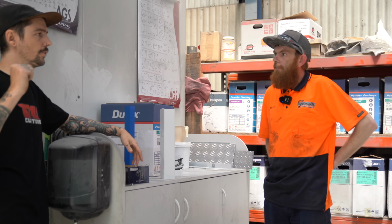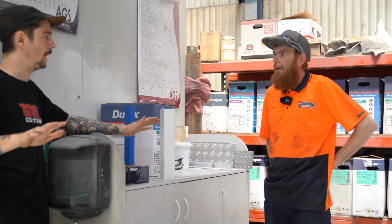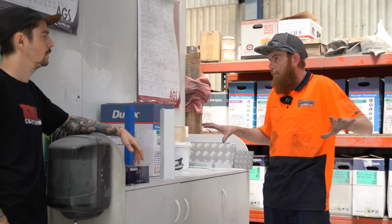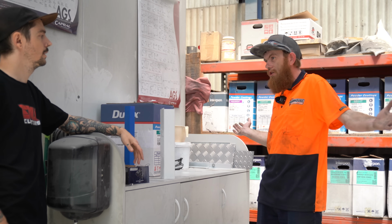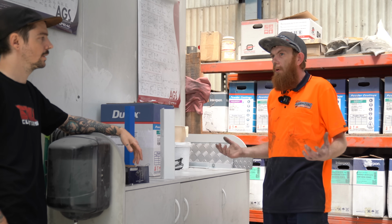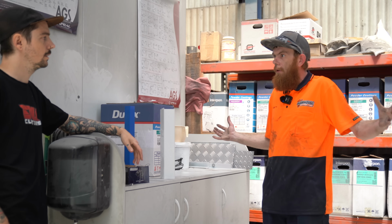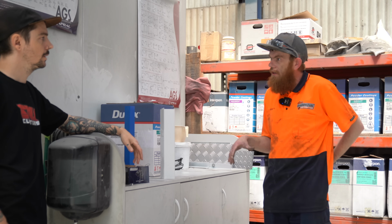And so the tray's in there at the moment just with bare sandblasting. And what's that for? Over time, things can get embedded into the steel. And when you're powder coating it, you don't want to cure your fresh top coat and something bubbles up through and you're left with a rough patch. So you give it a cook out, open the steel up a little bit and all the impurities will come out. Same with any gases and oils that have been embedded into the steel.